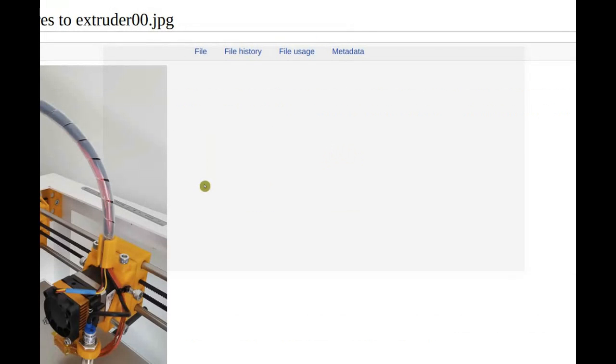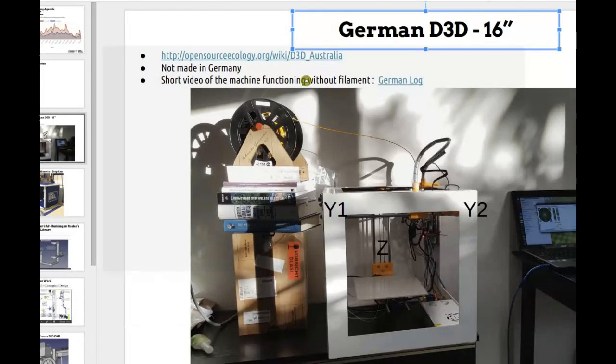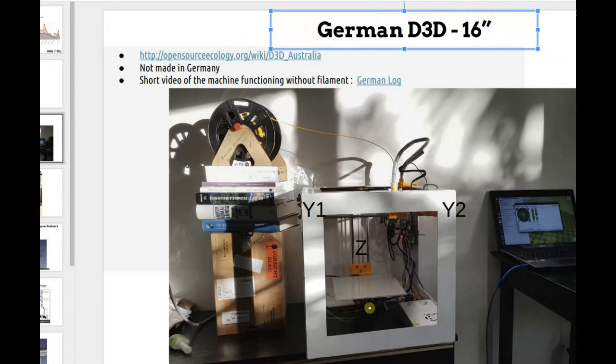It's interesting about the cable guide. I'm wondering if that's something we should consider, though that will change once we get the Prusa i3 extruder. But that's a good solution there to make that work. The only thing I would suggest to get your printer really, really good is that you have the one axis support. I would recommend two axes, because after a lot of time it can get bent over. It works, but you're going to have to mess with that down the road when you bump it or something happens. So in other words, putting a second Z-axis would be a good idea.